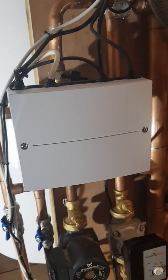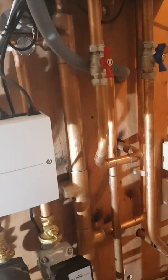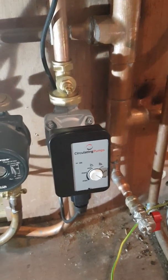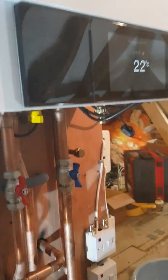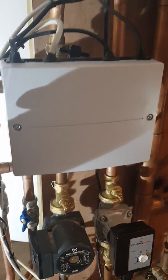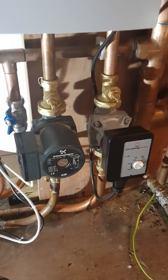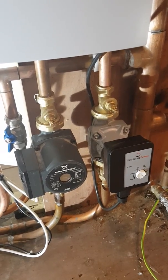That's it — it's a mixed circuit going down to our underfloor, which gives us completely flow temperature matched to the heating requirements on the ground floor. And we've got the unmixed circuit for radiators on the top floor. It's all on weather compensation, so perfect temperature control as normal. Nice and simple, and it works. As I've tried to explain before, this is actually cheaper — it's cheaper to buy this boiler and have these controls than it is to buy an underfloor heating system with all the various room stats and the fixed mixing valve. And the installation cost is lower as well. So you can have really top-end kit for a lower price. QED.